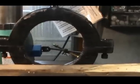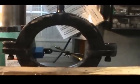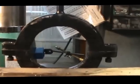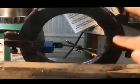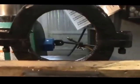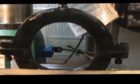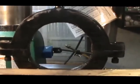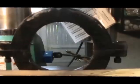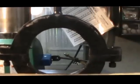So I've got a little bit of work left to do here to dress these up, and then that'll complete the horizontal joint and the two parts mated together. The next phase, we'll have to go back to the lathe and machine the bore out, and I'm going to put an undercut in this surface right in here, and I'm going to put brazing material into that for a wear surface for when it gets assembled to the clutch itself, the clutch pulley, so I won't have steel to steel working together. I'm going to have steel to the brass. So I'm hoping that that's going to work out well for longevity and minimize wear and galling.